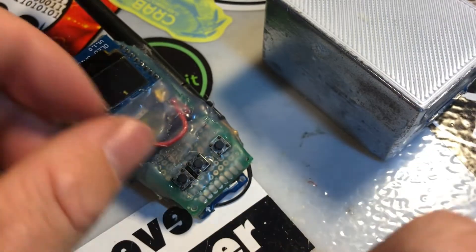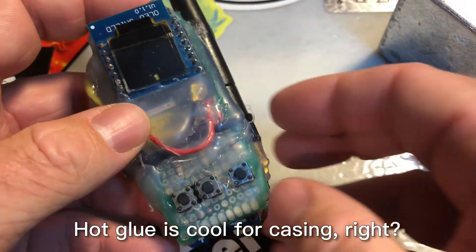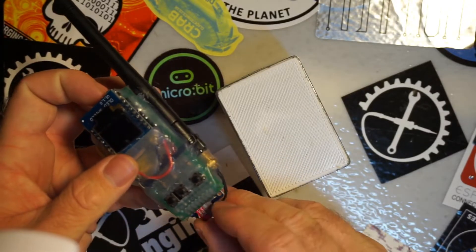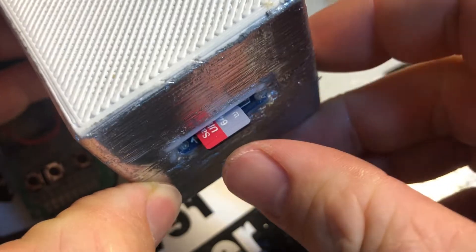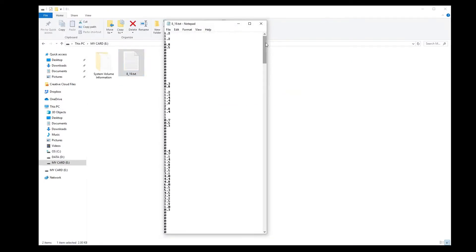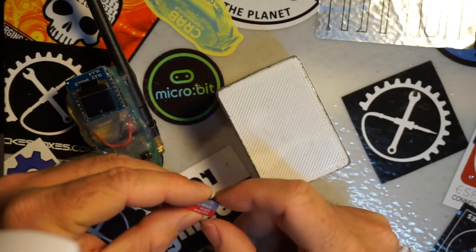So what would you even do with one of these cards in your project? I like to use it for logging sensor information, like a GPS device. For making it really easy to read and write configuration data or other files from the SD card — I can just edit it right on my computer. I also like to use these things for logging data and then checking it later on a computer. This can help a lot with things like debugging when you're not able to get a serial console to your device. And probably the most obvious use would be reading graphics or sounds from the card.